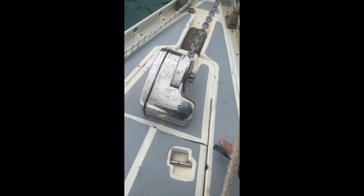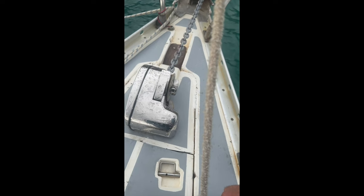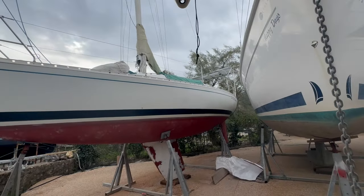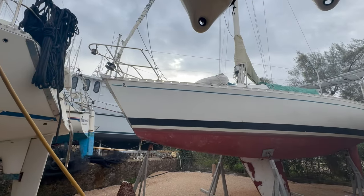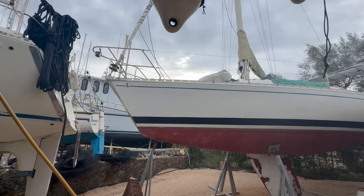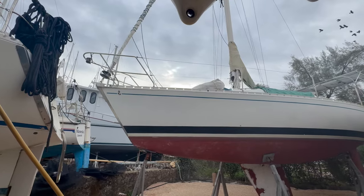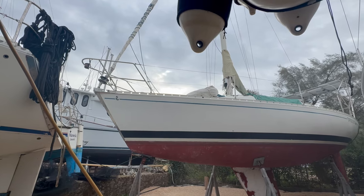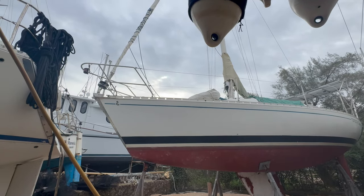I'll put this stainless steel strip across and put the hinges in to reinforce it as well, and basically just try and make this joint into not a joint. It's useful to have friends with a reference boat — this is another Beneteau First, and they've altered the chain locker exactly how I'm doing. I've been up and had a look, and basically what they've done is fiberglassed underneath to bond it, which has given me ideas in terms of what I need to do. I still think I'm going to take it off and grind away the gel coat on the groove and fill in the groove as well. But it's given me the ideas now. I'm happy with that — I just need to get some dry weather.